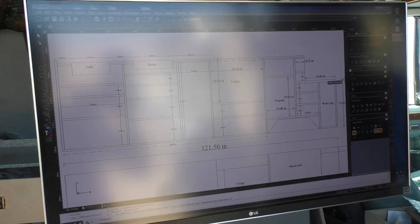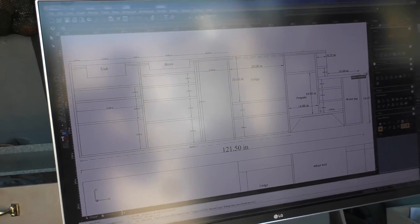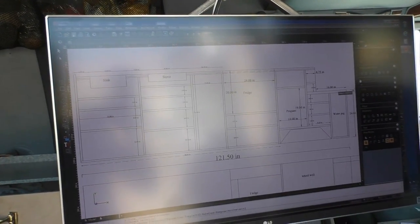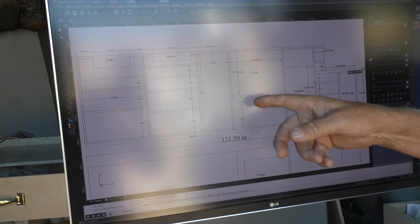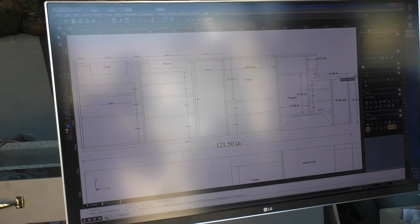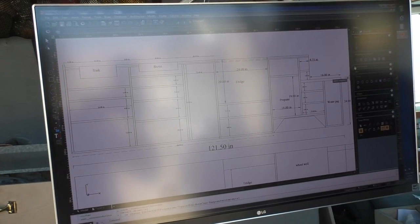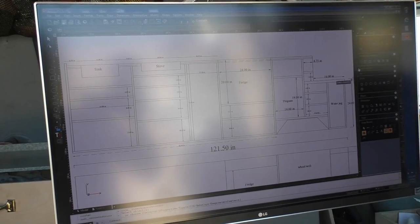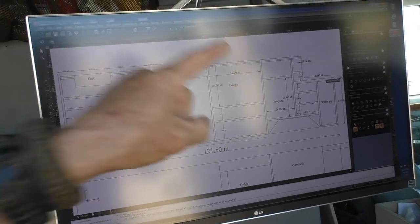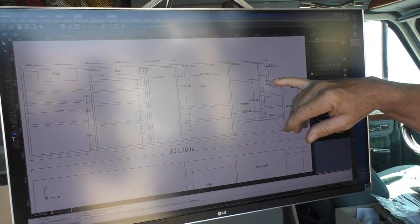Are we going to go with the two golf cart batteries? I've got two of the 12 volt VMAXs wired in parallel. Okay. AGM. Yeah, they'll fit in there, and then we can set up a little panel recessed in there, put in the controller and the fuse box, and maybe that can be the little electrical center down there. And then can we stub out right here for an inverter mounted horizontally, plugs out facing? That's what I've got here.